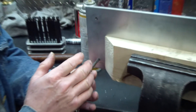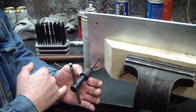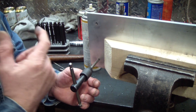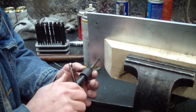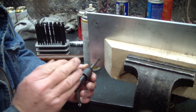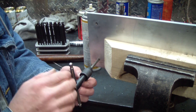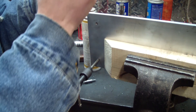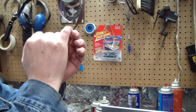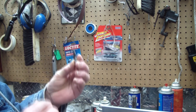There are different types of taps. If you have a blind hole — meaning there's a bottom to it — the crumbs can go to the bottom, and you want as many threads as possible to hold something on, like a head. You would want to start out with a tapered tap and then get a bottoming tap where you'd grind the bottom flat. Because this is all wasted space — you could get another three threads of holding power if you used a bottoming tap.